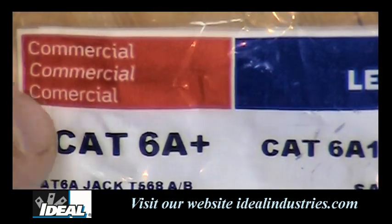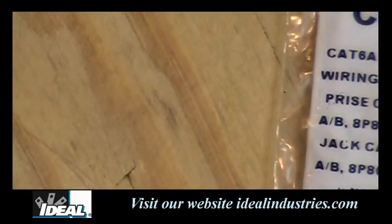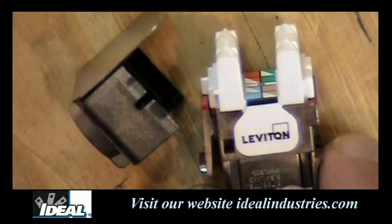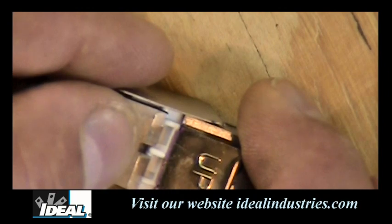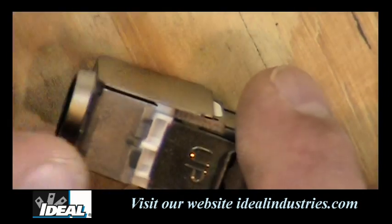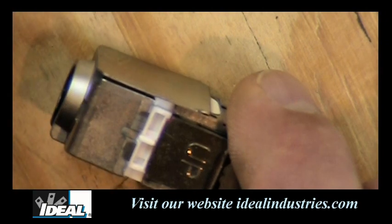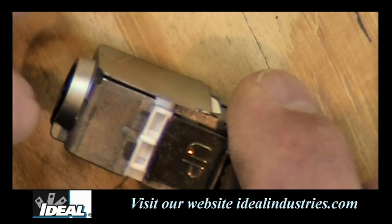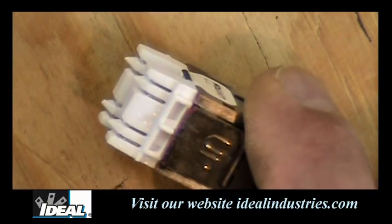Here we're looking at the packaging of a 6A connector — it says 6A right on it. The connector is made by Leviton, so you know it's good quality. Taking it out of the packaging, you find two parts: the actual body of the connector itself, and a little dust cover. This dust cover has a unique shape and is keyed so it will only load into one side and lock in. This keeps connectors aligned in a rack and also aids in eliminating alien crosstalk, which is a crosstalk measurement we may need to account for. We'll put that dust cover on last.